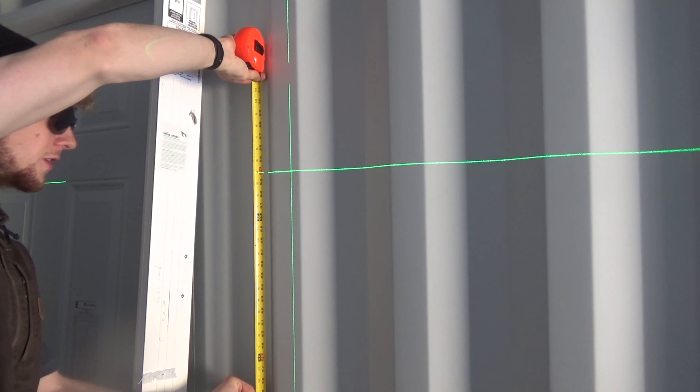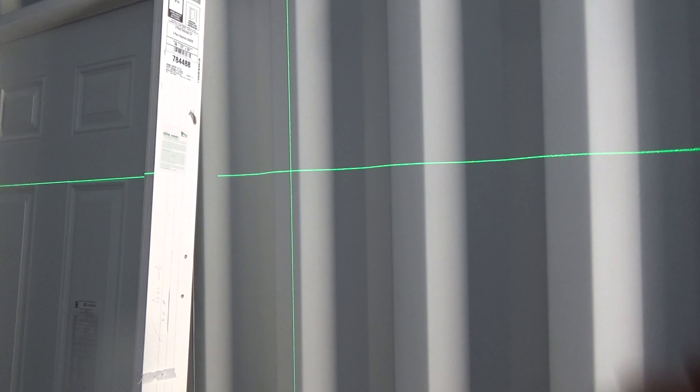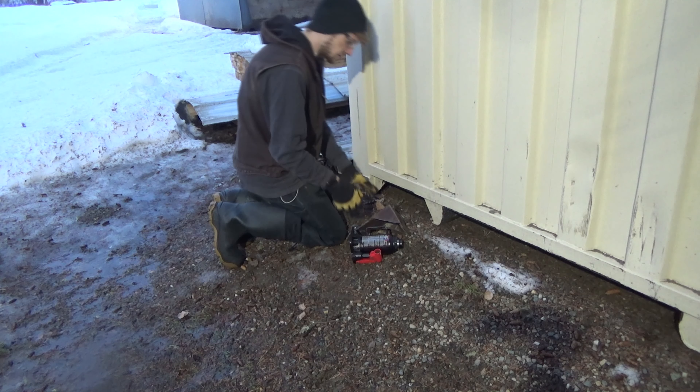That side's a little too high, this side's a little too low — I'm pleased with that. Going to measure the middle to check the droop from this side of the sea can hanging in the air. If all is to be believed, we have about 1/16th — maybe 3/32nds — of droop over the 40-foot span, and I'm happy enough with that. I'm cutting near the middle and my fab tolerances are probably within a 16th anyway. Eventually the sea can will be supported on six sections.